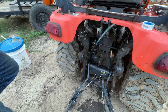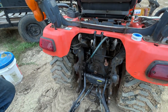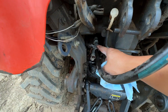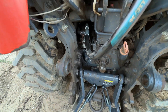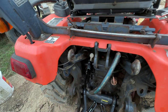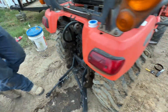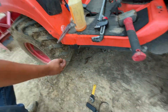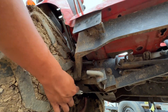So if you have loss of power for this tractor, you may want to check this connection right here. For us it was leaking hydraulic oil all over here. Once we fixed that, we also replaced the hydraulic filter — it's on the bottom right here, on the right-hand side of the tractor.